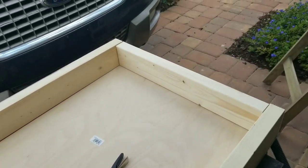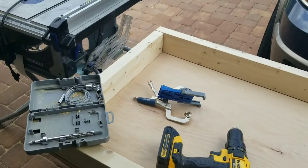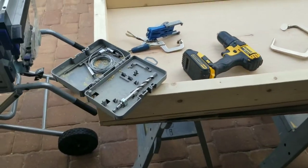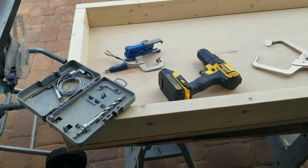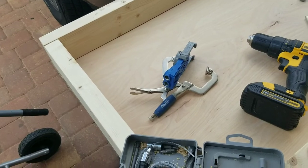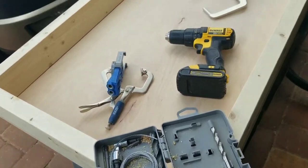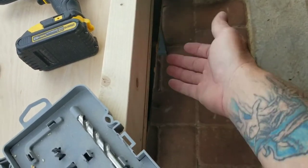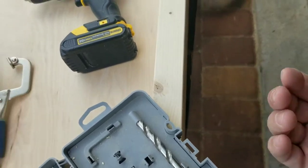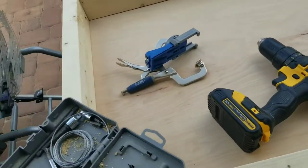Go ahead and cut those — you need two of each. Keep in mind you're going to be doing double what I'm doing here because you've got a board on either side of the game; I'm just doing one here to make the video easier to follow. The next step is building the frame. Some people will drill through the top down into the side, but I don't want screw heads exposed, so I'm going to use my Kreg jig in the corners.